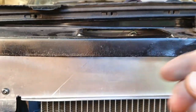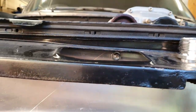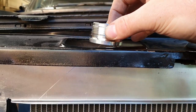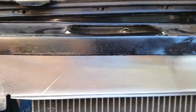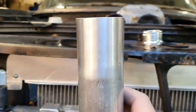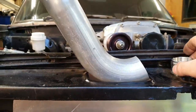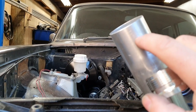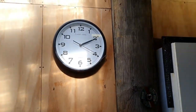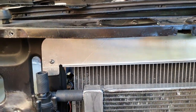But what's under here, which I didn't pay attention to, is the cable release - bonnet release cable for the bonnet release. I should get my words around the right way. So what that means is the top of the tank sinks down quite low. It has to be down there to be clear of that cable, which means you wouldn't be able to get the cap on and off without making this hole quite a lot bigger than what it is. I don't really want to do that. It just so happens I've got a piece of tube which is perfect size. So that can go on there pretty much perfectly and we'll do a short little extension - say about that high - onto the top of the tank. I'm desperately short of time today but I said I was going to get this tank done - that's what I am going to achieve today.